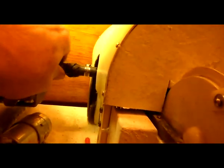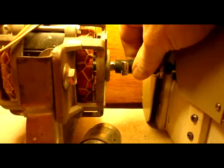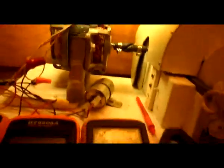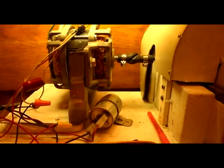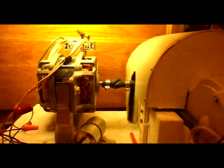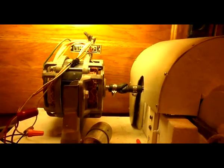You'll see the cogging. I mean, this thing is hard to break the lock on that. That lock is twisting this rag joint up. Ouch. It really is hard to turn that when you first start, and then it floats freer, but there's a lot of drag there. Now, when I hooked the motor up without anything on it, I was running about maybe 180 or 120 milliamps. Then when I hooked it to the rotor and ran it, it was at about 250 milliamps. It's a very small rotor. It's a very small 10 millimeter shaft and a very small rotor inside there.